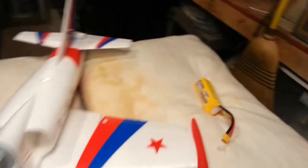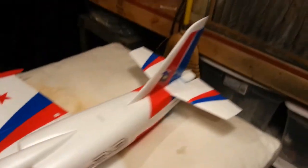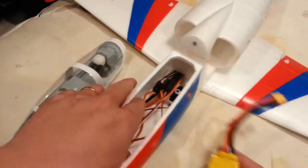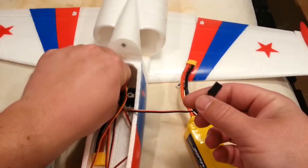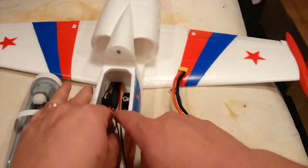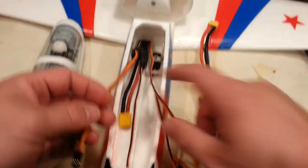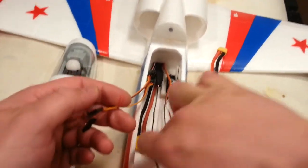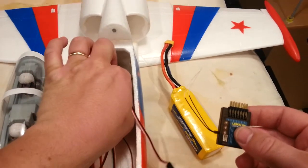So we're at 24 minutes. We've still got a couple of things to do: receiver needs to go in, gotta get it taped over, battery, and wiring needs to be cleaned up. Those extension cords may turn out totally useless — it's really close. There's also a servo extension added on to the electronic speed control. Let's grab the receiver and plug it in. I'm going to turn on the transmitter with throttle cut on — this will be the first time we've actually energized anything in this plane.